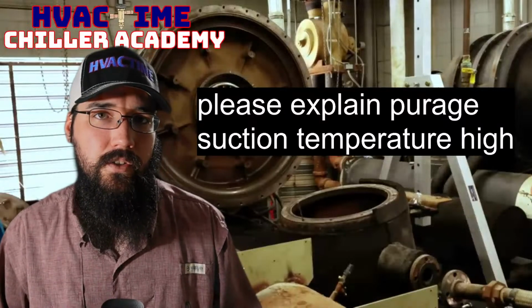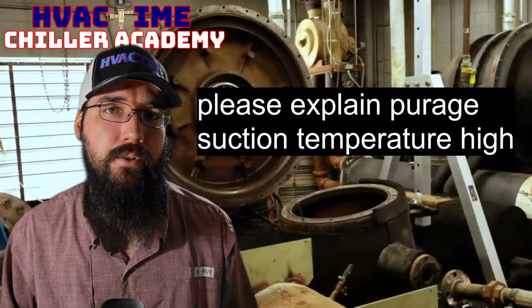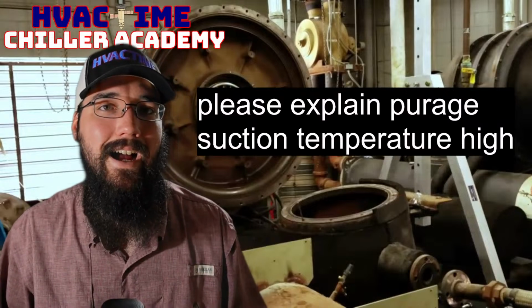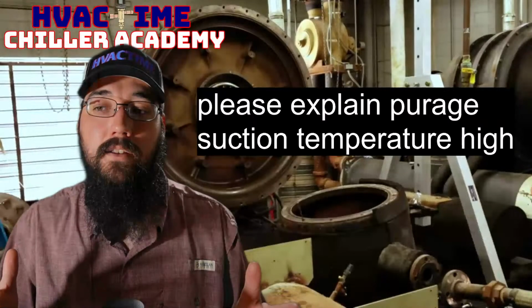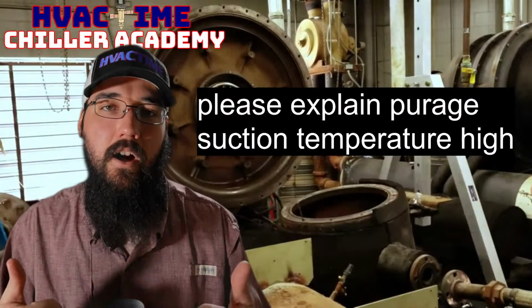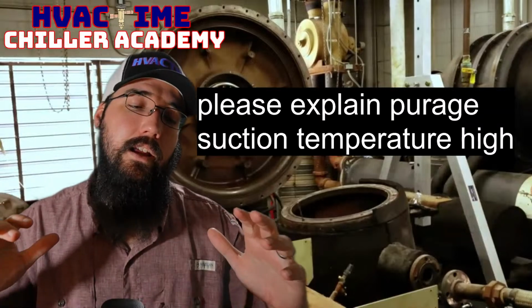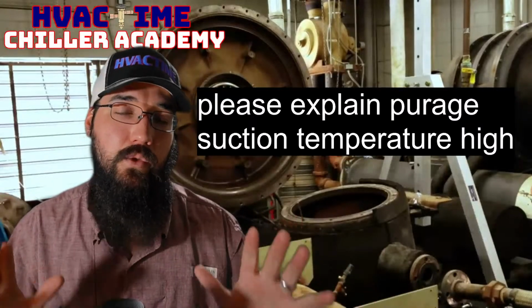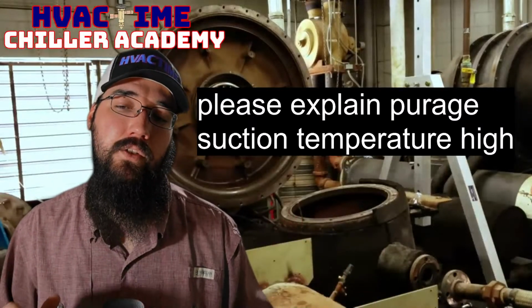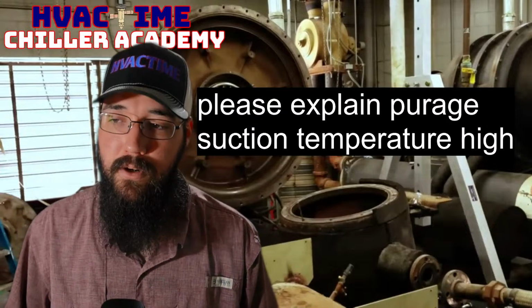Anyway, so yes, a high purge suction temperature could be these other conditions. But if you're not having surging issues, you're not having high pressure issues, and the purge is just running a high suction temperature, then you're probably good. Okay, it's cause to celebrate. You're low on condensables, if any at all, and things are just jiving away. That's what we want to see. It's when this suction purge temp plummets that we know we've got a problem.